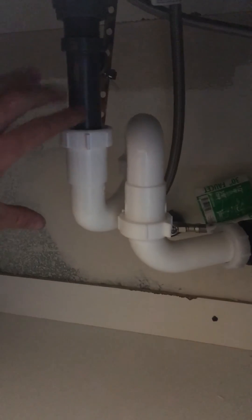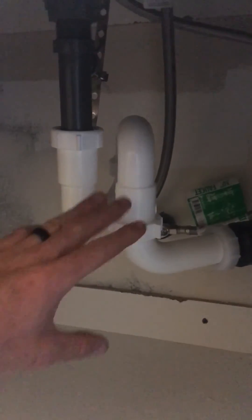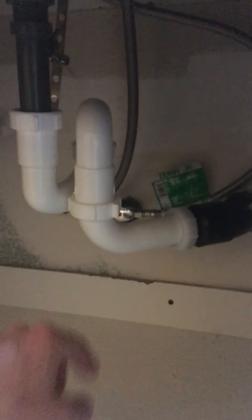because that water helps keep fumes and vapors from coming back in and up through the drain. So we always recommend having just a P-trap, not an S-trap. What could be done here is to make this a little longer and put the P-trap down connecting directly to that drain. That's all.